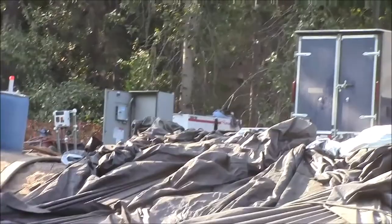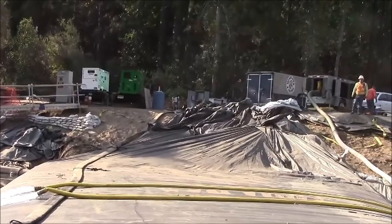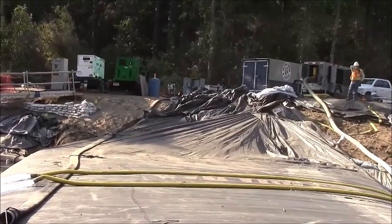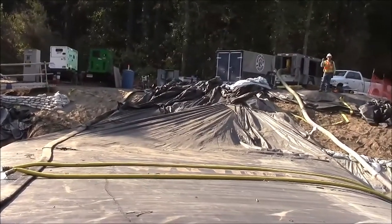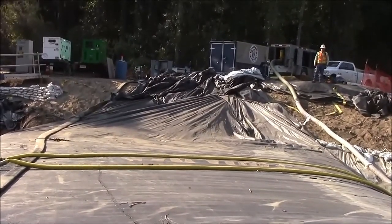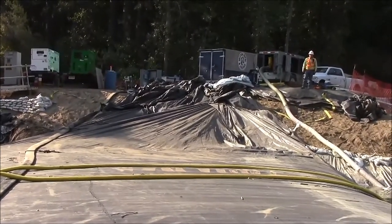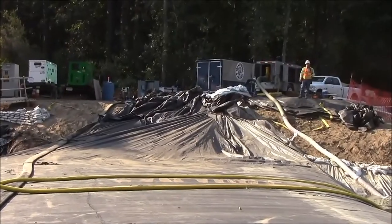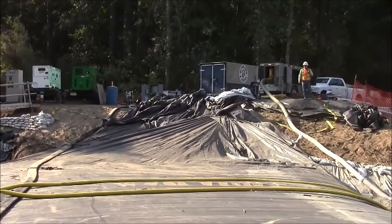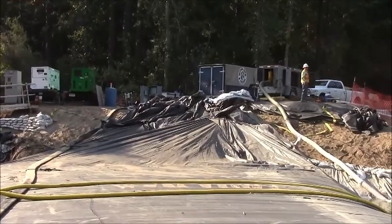And the angle to the bank was changed. So now the fill tubes want to pull to the left, which is not ideal. Our solution here is to rewater the work area, dewater the AquaDam, and using a trucking strap and a crane, lift the open end of the AquaDam, forcing the water contained into the remainder, allowing us to reposition the start of the AquaDam to a more beneficial configuration.